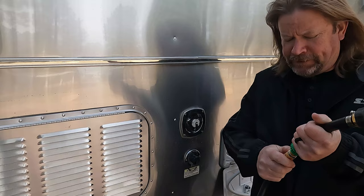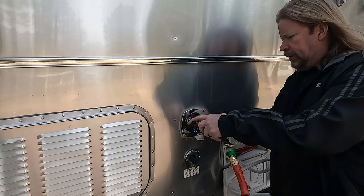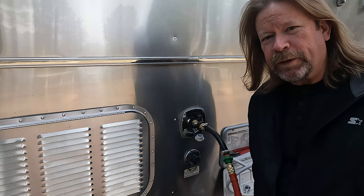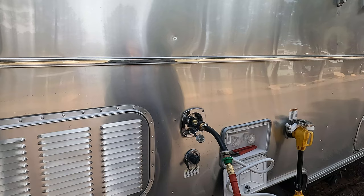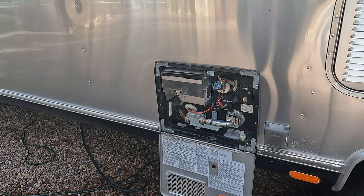So now we're going to hook my handy dandy tool up. I'm going to put it on the potable water city water inlet. I seem to have a small air leak — I'm okay. Then turn that water on. Now you can hear water coming out from the low point drains — they're mostly just air. That's a good sound. I turned off the low point drains and opened back the water heater bypass. You can see the gunk that's coming out — I need to get a wand and clean that out.